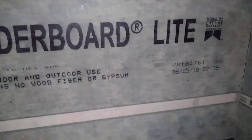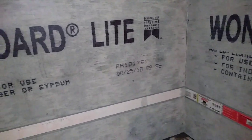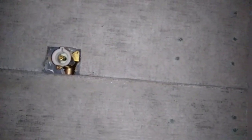So basic measurements here, easy. That's 60 across, we know that. And we have a net opening of 60, which is real nice. So we don't have to cut that backboard, except for its top, okay? I always maintain half inch off the ceiling. Okay, your diverter, just enough to clear everything there. You wanna be able to get the screws in the trim kit later on.